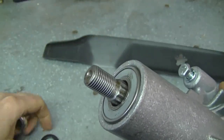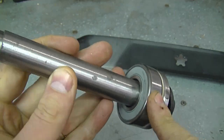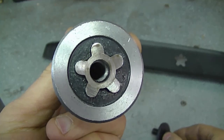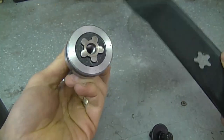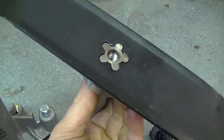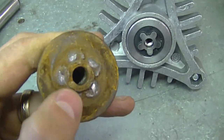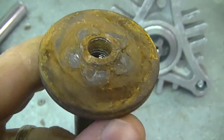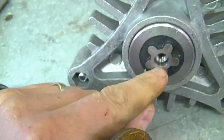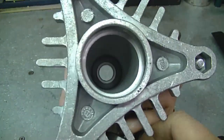Now the shaft should come out. All it is on the inside is a shaft like this — one of the bearings is still on. Here's the bolt for the blade, and over here you can see a star pattern for the blade to go on. This is how the blade goes on — fits in there like this — and then you reinsert the blade bolt. A quick tip: sometimes the star pattern ends up being stripped, as you can see on this old shaft from the same spindle. If the star pattern gets stripped like this, just replace either the shaft or the whole complete spindle.